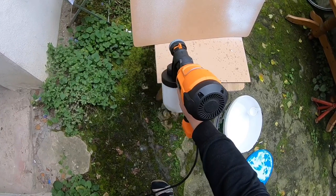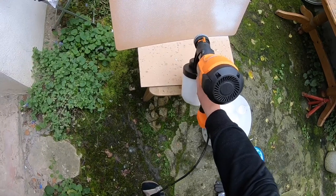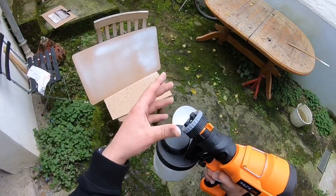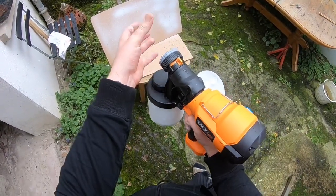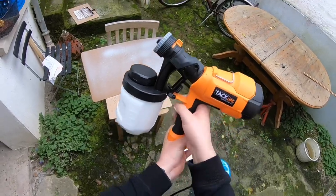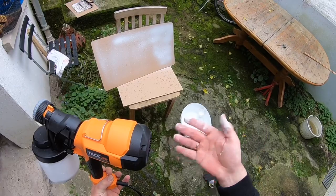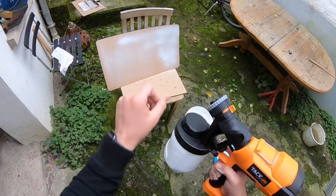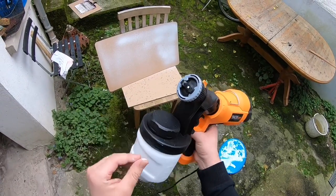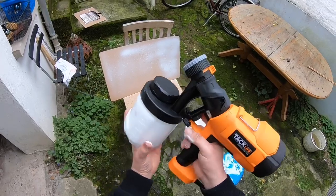If you choose the spray tip of 2.5 millimeters and a nozzle with 2 millimeters, that means you can use polyurethane, chalk and milk type paint. This is the recommended material. Recommended viscosity is 40 DIN. This is for projects like railings, multi-frame window frames, heating pipes, boats, yards, furniture, garage doors, metal garden fences.